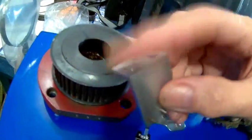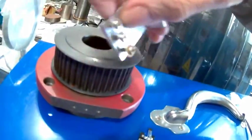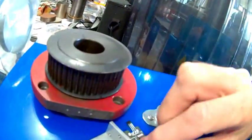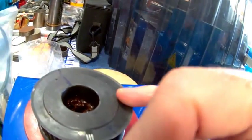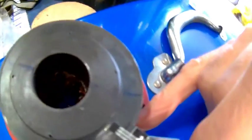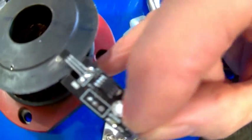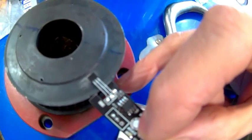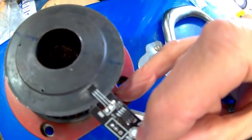I've made up a bracket that bolts on to the three holes I've drilled there. It fits on top, and as the spindle rotates, it will have the sensor. That can be used for the tachometer, but when you're doing threading or tapping, it also gives you position.